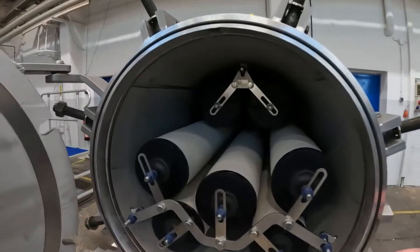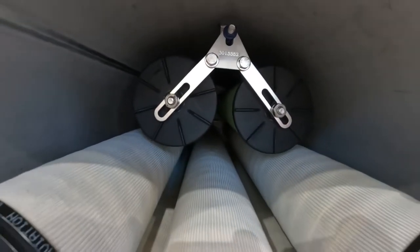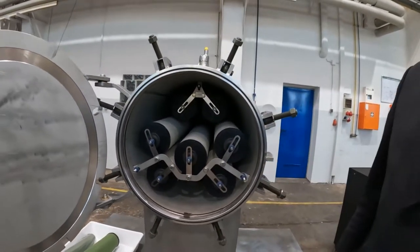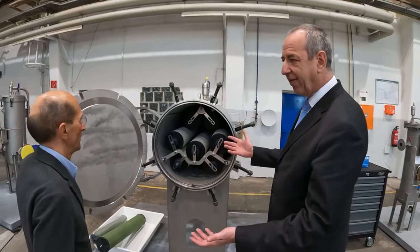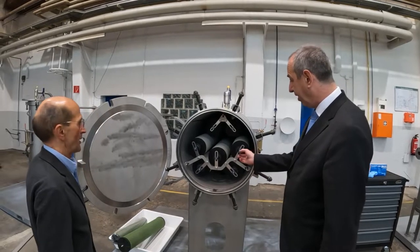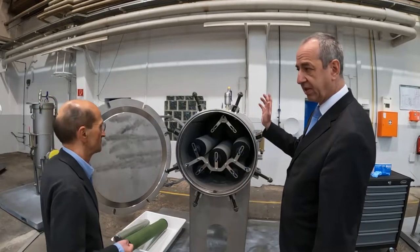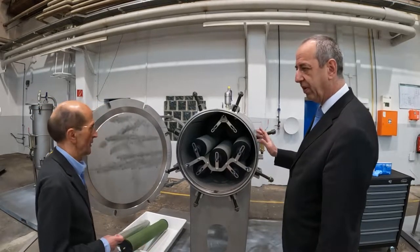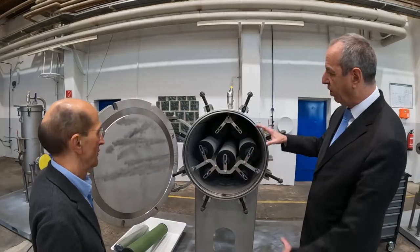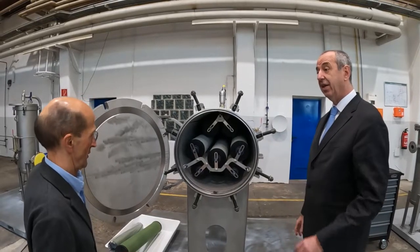In this environment, on the coalescers it is open-ended, and right now we look at the separators which are screw-based separators, which is quite unusual — but in a lot of cases we try to use screw-based separators because they make life on the installation side a little bit easier. The flow rate of this one is about 3,000 plus liters per minute, so it's rather small. If we go for bigger vessels we go up to 9,500. It's important to show horizontal design first, and later on we will see vertical design.